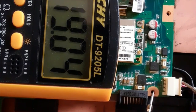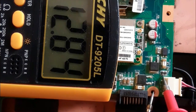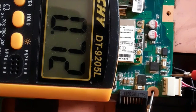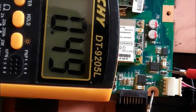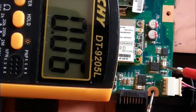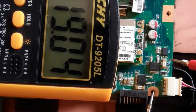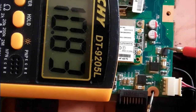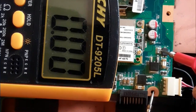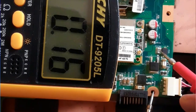We should find 19 volts — and we have 19 volts. The signal wire also has 19 volts. Let's check the other side: these two SMD coils — first coil has 19 volts, second coil has 19 volts. Let's check the other sides of the coils: 19 volts, 19 volts. The fuse: 19 volts on both sides. The double diode: 19 volts on both sides. The current sensor resistor: 19 volts on both sides.